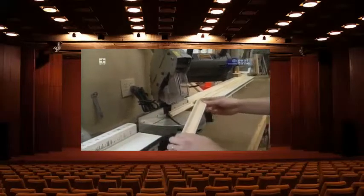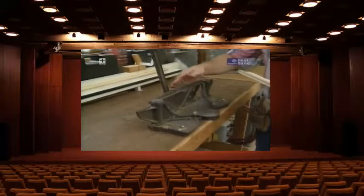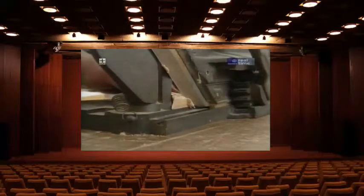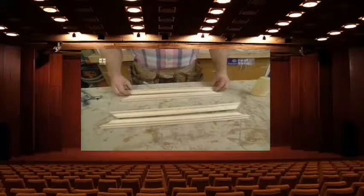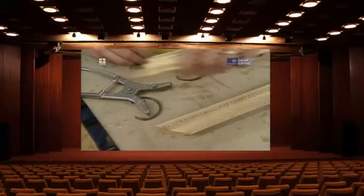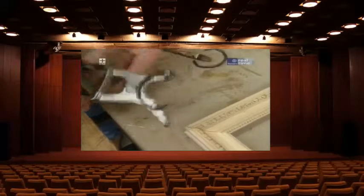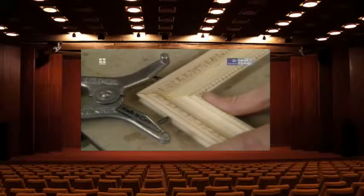A power miter box does a good job cutting 45-degree angle cuts, but at the workshop there's also a trimmer — a tool with two very sharp blades that work like a guillotine — which produces a perfect 45-degree angle. A tip: to ensure the joints fit perfectly it's absolutely essential that opposite sides of the frame are cut to exactly the same length. To join the corners, yellow carpenter's glue is used, and a spring clamp secures the corner while the glue dries — slipped over one of the springs, spread open, brought over the corner to dig into the wood and squeeze the joint together.